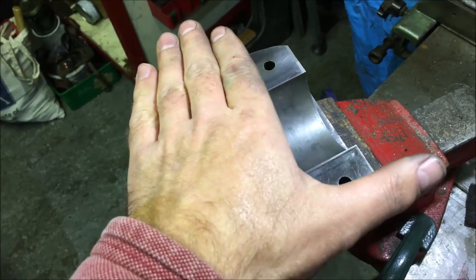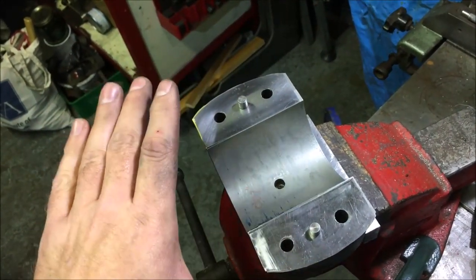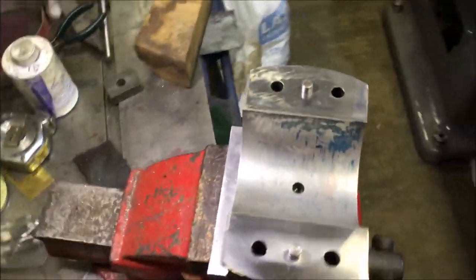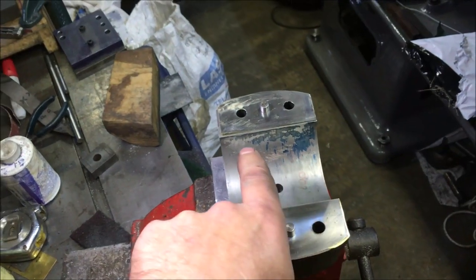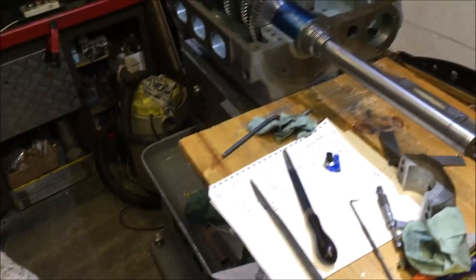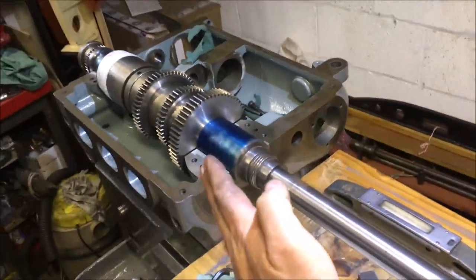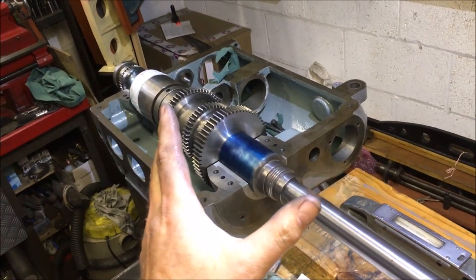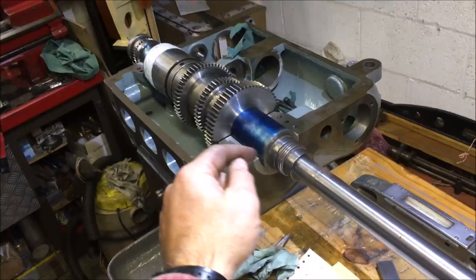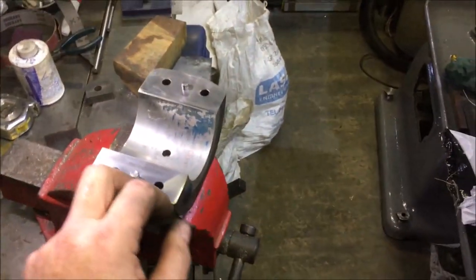That's sitting it up, but there's still some drag on the spindle shaft as it's rotating, so I know that there's an ink transfer. And this is the second cycle, so you can see I'm picking up ink in the corner here, which is down there, which corresponds with how I had to move the, if you like, when I scrape the bottom half, the spindle's gone that way. So what I'm doing is basically roughing it in first, and then we'll look at going for contact.